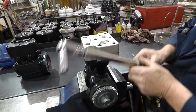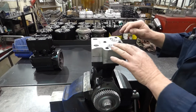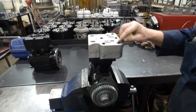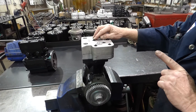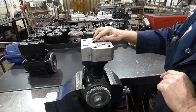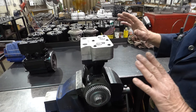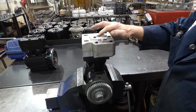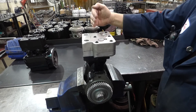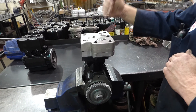After you've done that, take the five small bolts. Follow the sequence on the sheet and torque these to four foot pounds, or 48 inch pounds. Four foot pounds are hard to read on a torque wrench, so you might want to stick with inch pounds — 48 inch pounds on the small bolts — and then once again you're going to turn them 90 degrees. That gives you your torque to yield.